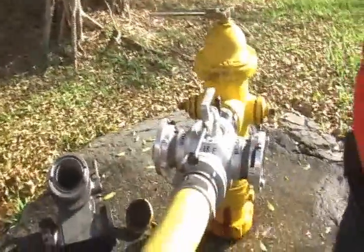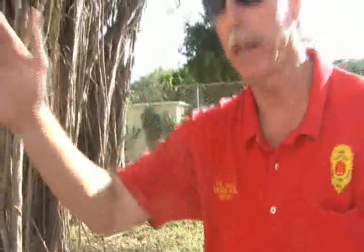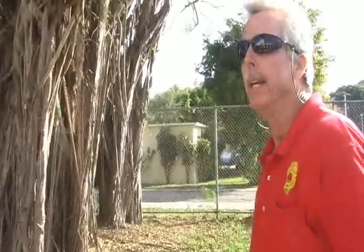If the pressure needs of the fire exceed what is now available, it's necessary to bring in the second pumping device, or the second pumping apparatus. The next part, we will simulate the hookup of that second-in pumper. The second part of this training film is to show you the transition between the hydrant pressure being supplied and the second pumper coming in to boost the fire line pressure.